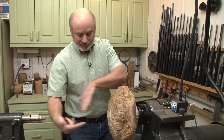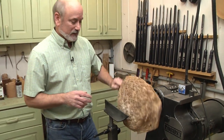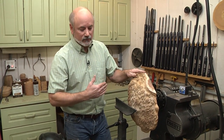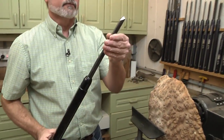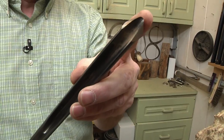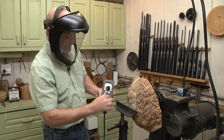Next we're going to start turning on this side. Remember when I took so much time to balance this — look at this, it's almost perfectly balanced. It's still going to wobble when we start it, but if it's out of round, it's going to shake any lathe you have. This is an 800-pound Robust American Beauty and it's not supposed to move at all, but you can't beat physics. This is definitely a mask project for a while. I've got my half-inch rough bowl gouge and I'm going to use a bowl gouge throughout this entire process because the grain is so swirly and strange — I need this aggressive tip to just go in there and take little bits of wood at a time.